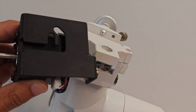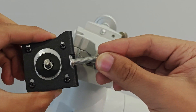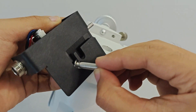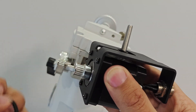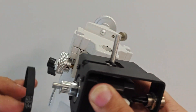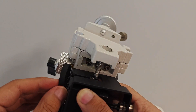Take out the declination motor assembly. Slide the flathead hexagon socket screw into the notch on the front of the motor bracket and install it into the second slot. Install the 16-tooth synchronous wheel on the motor shaft without tightening the fixing screws for the time being. Then put the 150-tooth synchronous belt on the wheel and insert the motor bracket from under the equatorial mount.